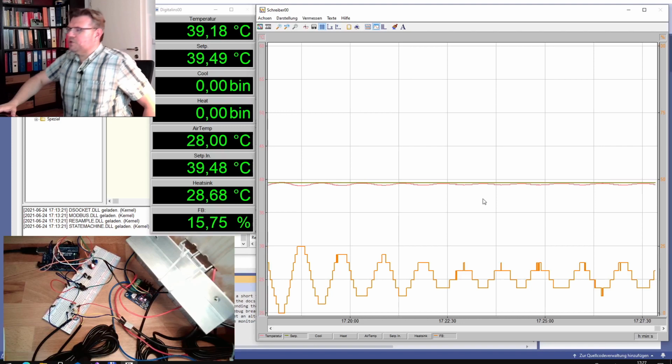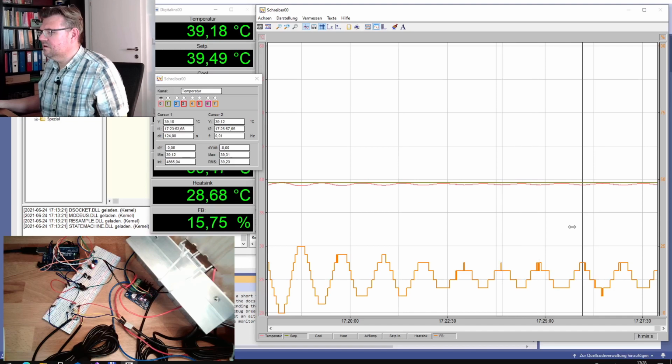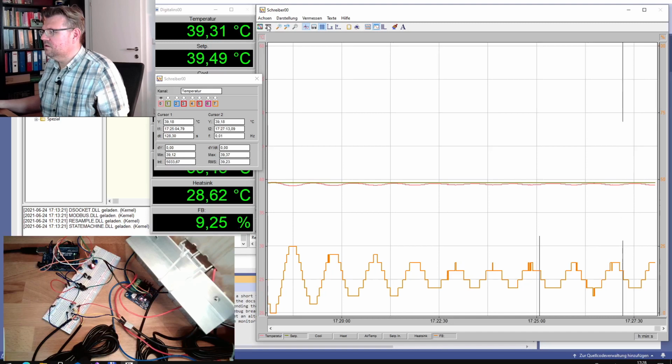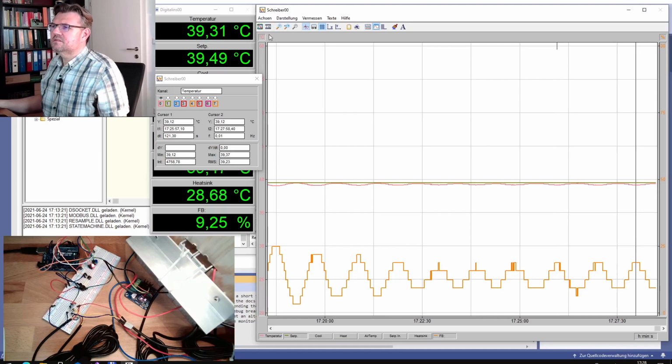Okay, so let's measure the swinging period time. We'll freeze this. Let's see here and here. We are at 62 seconds here and here, we're at 66 seconds. Here and here, 58 seconds. Let's proceed. Freeze. Go in the middle, go here also in the middle, these are 2 periods, 120 seconds, so 60 seconds seems to be now the swinging period.